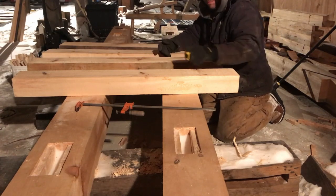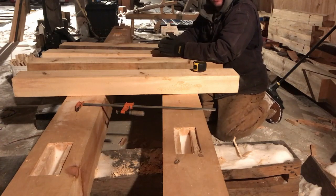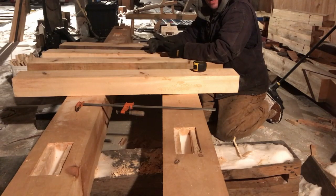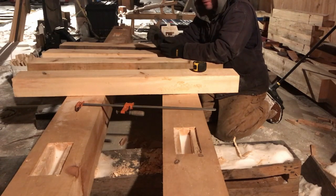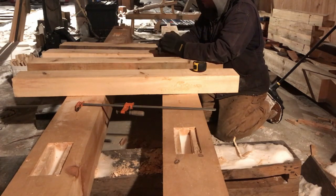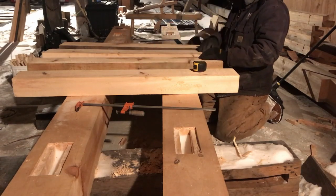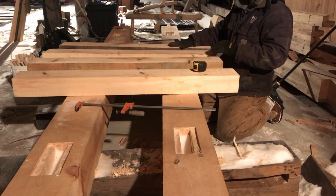So what does that mean? So the 3 7/8 piece, I have to make a decision on how I want to cheat this. Now, seeing as how my brace mortises are already cut, I kind of need that 2-inch mortise on there. So we're going to be losing that 1/8 inch on the shoulder of the tenon where it sits into the housing. That's where we're gonna lose it there, or on the width of it. So we can live with it though, we can deal with it. It's on these last two.